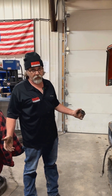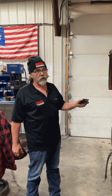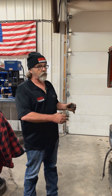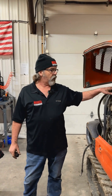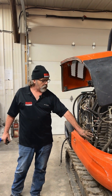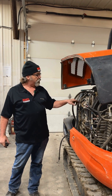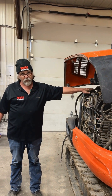That's the installation on a Kubota KX-040. The 057, the 080 — all the Kubota models we've done so far all set up exactly like this. On other manufacturers, you're going to have a different interface. Some of them will go in inline with the filter; others will go in to a port on the tank. But in one way, shape, or form, they always return to tank.